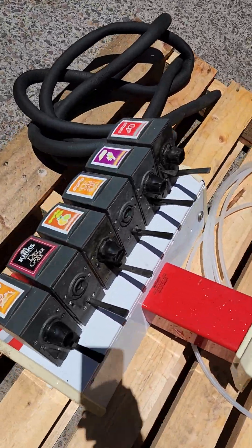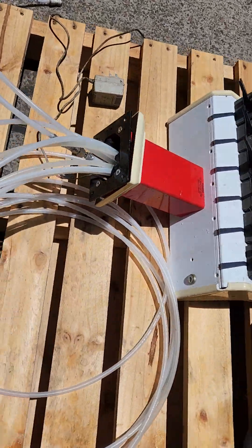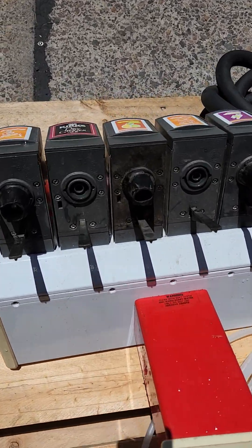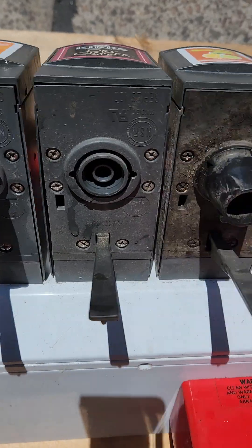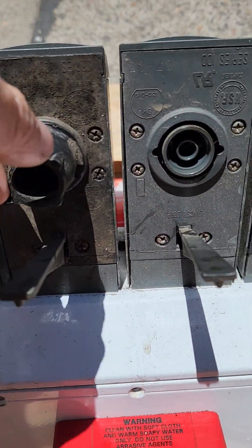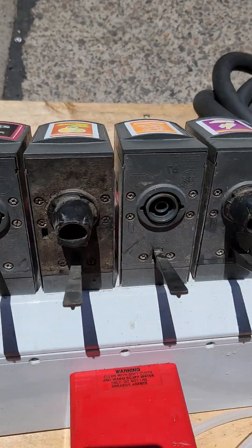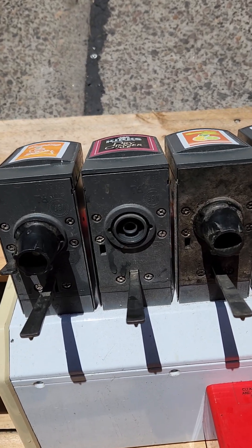This is the tower. We've gone over it pretty thoroughly — changed all the piping, checked out the electrical, and changed out most of the o-rings because she's leaking like a sieve on the bottom. There are the nozzles and the diffusers. They didn't come with any on there. I managed to find four secondhand nozzles and three diffusers. Another six are on their way from Lancer, hopefully arriving soon.